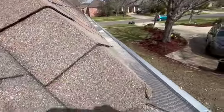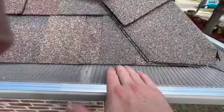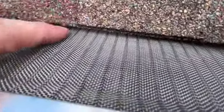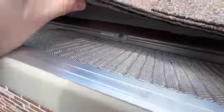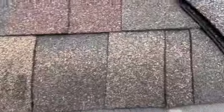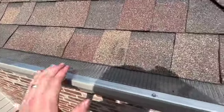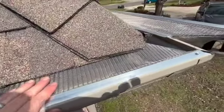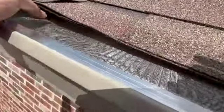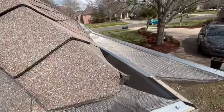I'm back at the beginning with everything unscrewed. I want to point out that the way I had it before looked fine but it angled almost downward slightly. I realized there's a better position in the back so there's no gap between the shingles and the gutter guard. Under here I need to lift the back up onto the correct spot. The new position has the back angled up so it slopes down, meaning leaves won't be able to make their way in between the shingles and the gutter guard — a much more secure fit.